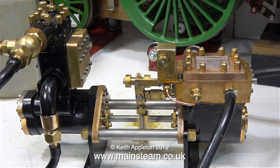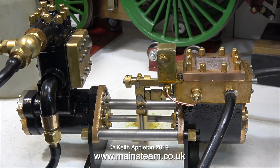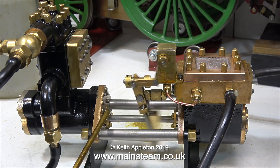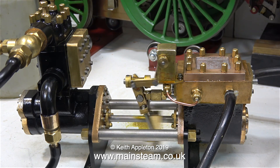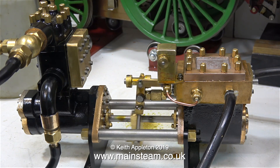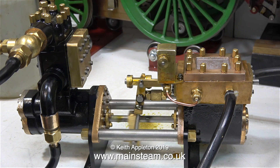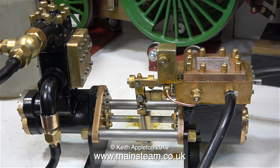I wonder if the pump's going to run. Well, as usual it runs on compressed air, but I can detect a slight blow. I really do think that the original shuttle piston, which is made from brass, is actually bent — only very slightly from the looks of it, but it's just enough to make it lock up when the whole thing gets hot. The original plan was to give it another steam test at the end of this video, but it's so cold in the workshop that the gas is too cold and I can't get much of a flame on the burner. But I think I'm going to make a new shuttle piston anyway from stainless steel. So that's it for this one — thanks for watching and I hope you found it useful.